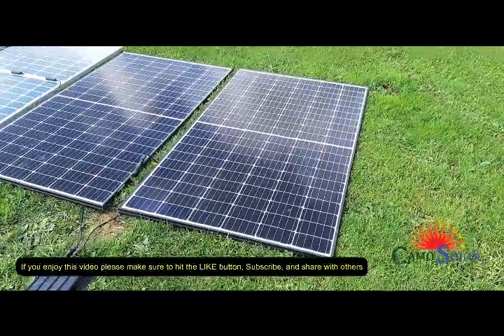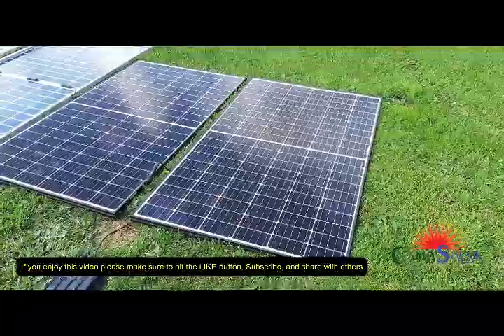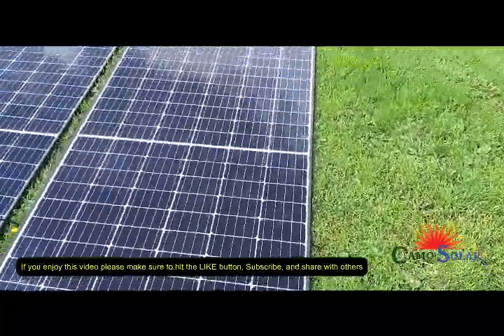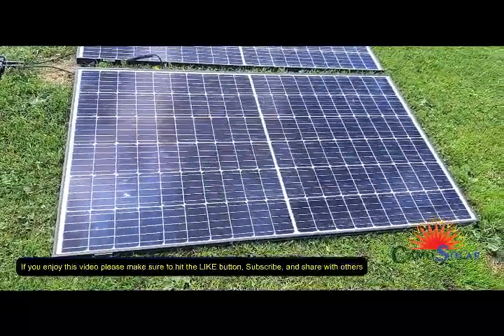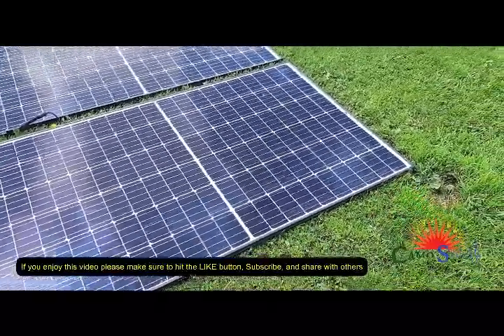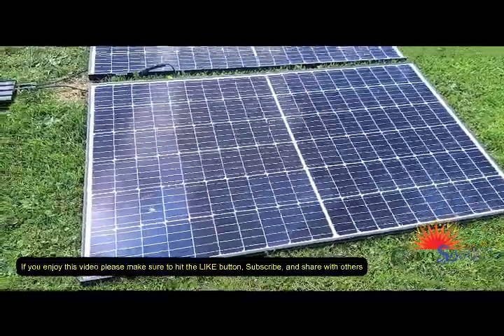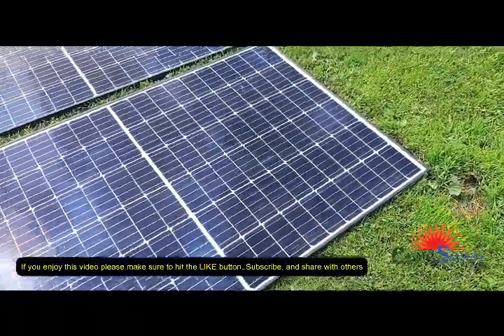Something else I want to say here: quite often you see solar panels on Kijiji for sale for somebody to put on their holiday trailer. These solar panels — just this one panel — I have put many of these on holiday trailers. Their exact dimensions are just under 40 inches wide by 66 inches long. It's a split cell, so if there's shading, the other half of the panel still produces while the bottom goes into bypass.